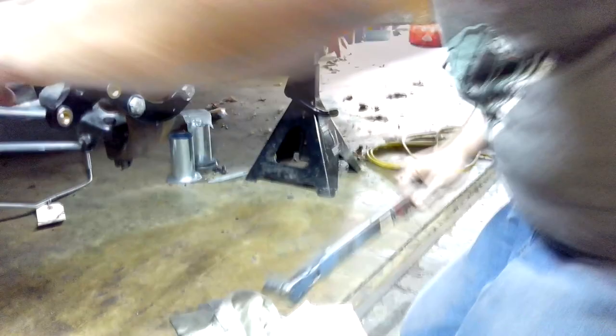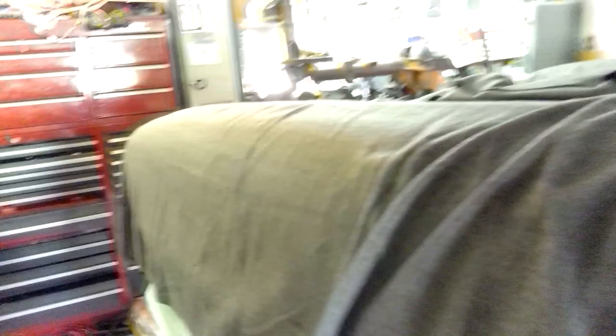Double check, then set the torque wrench to 140 foot-pounds and torque that top bolt down. When you finish with your torque wrench, always back them off.